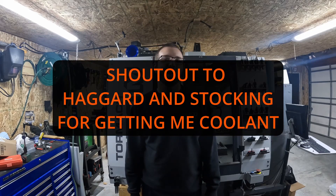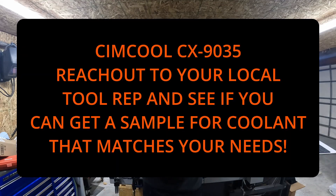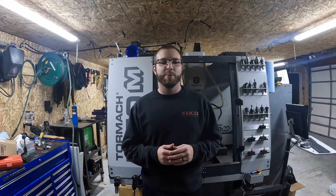I also wanted to talk about the coolant I'm running. A local distributor got me a five-gallon pail sample to try out for this machine — I believe it's Chem Cool. I'll put the actual model name of the coolant in the description. So far it's worked great and I haven't had any complaints. I do go to the store and buy distilled water to run in the mill — I don't use well water because of the minerals in it. It's pretty cheap; just go to Walmart and grab about 13 gallons. I pour in the water and then turn the pump on and start feeding in the oils to really get it all mixed together, since I don't have a mixer at home like bigger shops have.